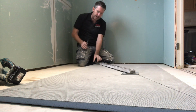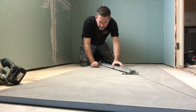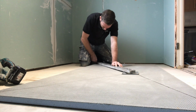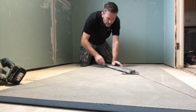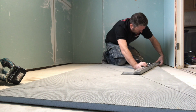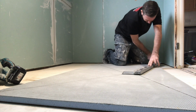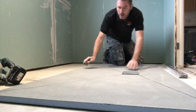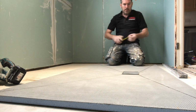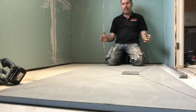Because when we cut this tray down, we cut it down equal gaps either side, them lines are going to move over, they're going to be over here. So, four corners. Over the fourth corner. Right, now we've got all four corners. What we're going to do, I want this tray 800 wide. So you just measure the 900 tray, 50mm. Cut 50mm off that side, 50mm off that side, and we make it equal.